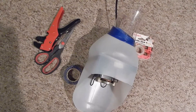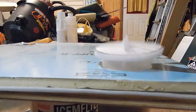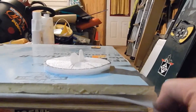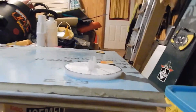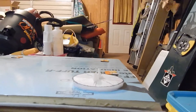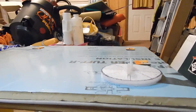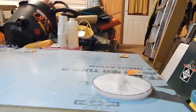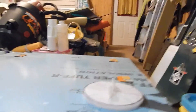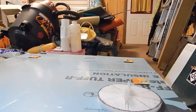That's the finished panel. I've got a little layer of soft foam between the wood and the other insulation for a little extra seal — it sticks out a bit to give more contact. I measured the size of the opening versus the panel and oversized my insulated panel just a smidgen, which will help seal the gap. I can always throw fiberglass on top too if I really wanted to, but I don't want the fiberglass there — it makes it harder to get in and out of the attic.